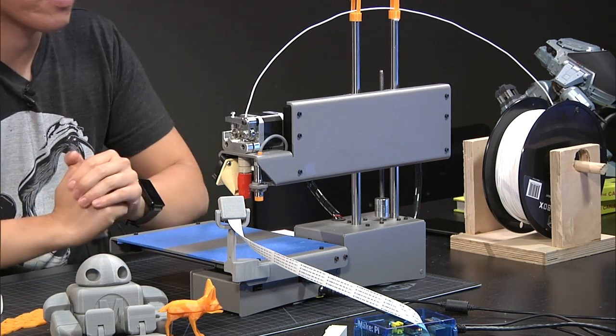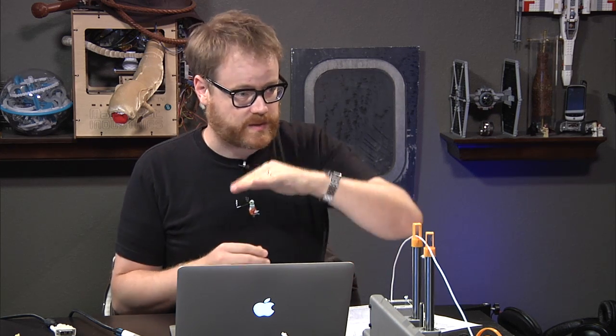The first thing I realized, a couple of things I realized very early on in the setup process, and with every 3D printer we've tested, all the Makerbots, this one and a couple of other things that we've had a little bit of time here and there with, there's always kind of a ramp-up period where you learn how the machine works because they're very precise. They require a high degree of precision. On a vertical resolution, one layer of plastic gets applied to the next, and that gap is anywhere from 1/10 of a millimeter to 3/10 of a millimeter in space. So you're expecting the motors to move in very small increments, but relatively quickly, and that's why they use stepper motors for 3D printers of this kind.